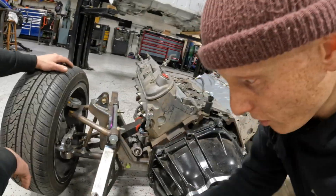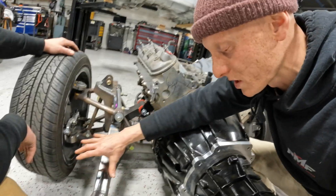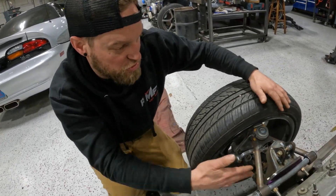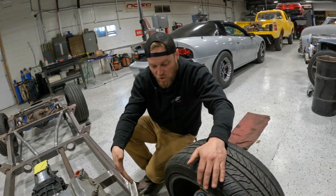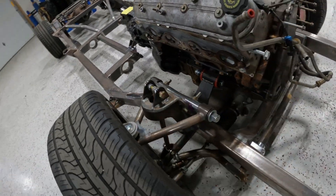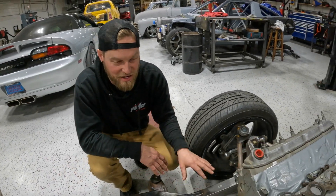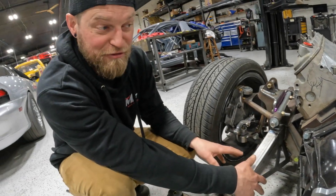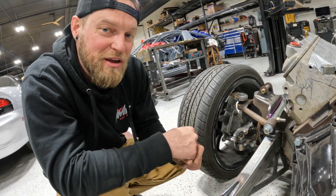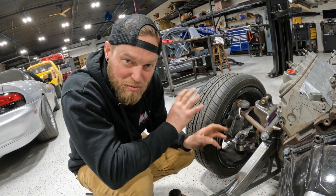Making our way up to the front, I see a lot of cool things — these gussets, the knuckle, the whole suspension area. I'm wondering how this is all integrated, because it's a G-Comp front suspension kit combined with our custom chassis. When you get the G-Comp, it comes fully welded. They've got two 2x3 tubes running front to back on either side to integrate into the chassis. We tied them in right at the high point, with a nice big gusset plate underneath the crossmember. That allowed us to really get the upsweep — plenty of tire clearance if he wants to run a bigger wheel up front. The big thing was getting it to fit underneath the S10's floorboard without additional cutting on the floor. One nice thing about the G-Comp is it doesn't use a traditional Mustang 2 knuckle — it actually runs a C6 Corvette spindle, so any C6 brakes and the standard unit hub all bolt right on.